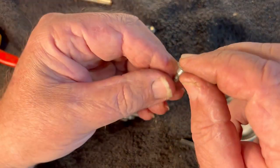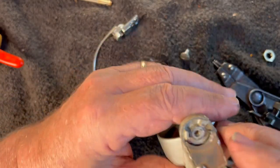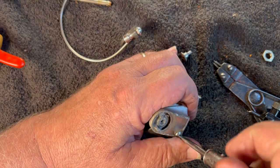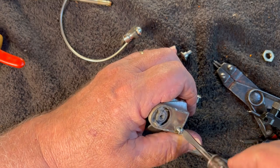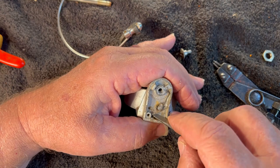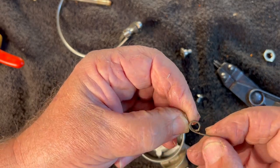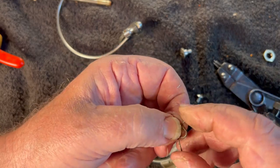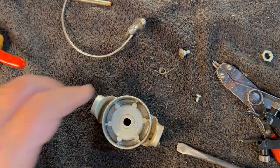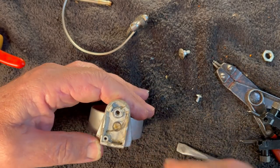Come out okay — definitely very dry. Let's see what's going on this side. Do we have a broken spring or do we just have some caked-up old grease? We have a spring that is not in its hole. It appears at first glance that it's all rusted, but it's not rusted — it's all caked up full of old grease. I think that's going to take care of it. Once we repair that and get that spring into the hole where it belongs and get it on, I think that's going to be fine and it's going to work again. But we've got to scrub all these parts up. We're going to clean them all up and I will be back with you in just a few minutes and we'll put it all back together.